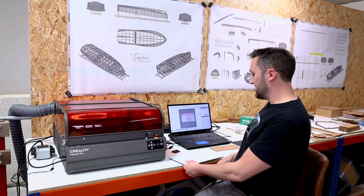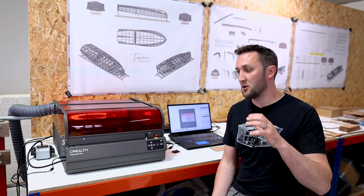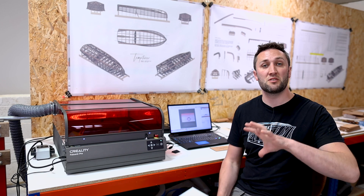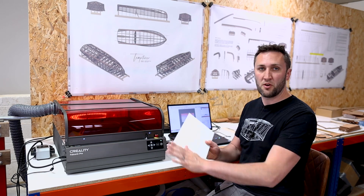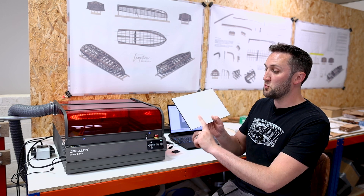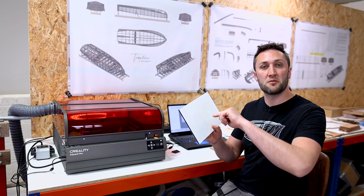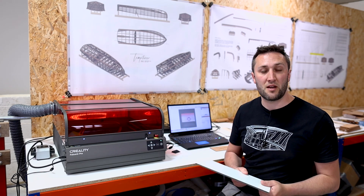So let's have a go at making something. The first thing I want to try is a piece of high pressure laminate. I want to try and make gauges — we're going to start with experiments on the gauge faces. This is a piece of high pressure laminate that's black in the core and white faced, so what we can hopefully do is engrave it on the laser and get some really sharp text outlines that are going to form the face of the gauge. I thought about possibly doing some anodized aluminium as well — I'm going to do some experiments and see what works.